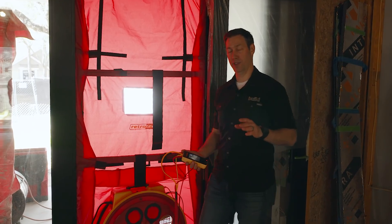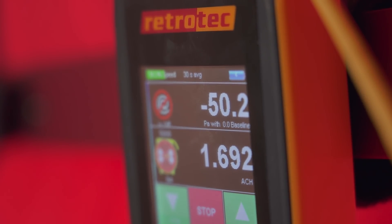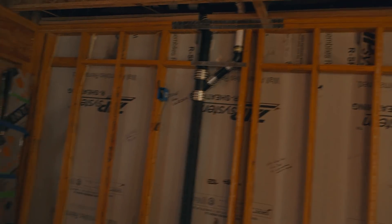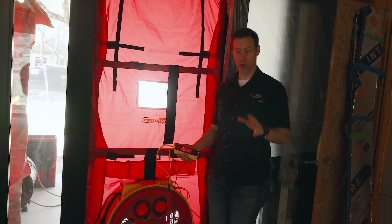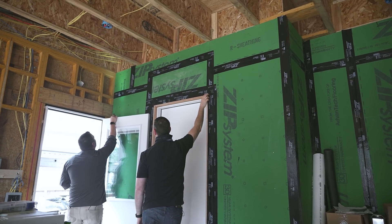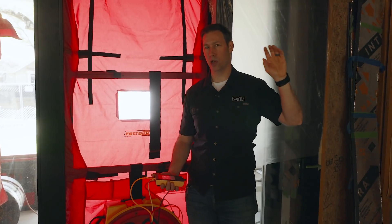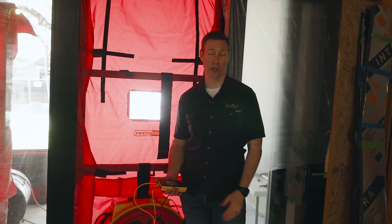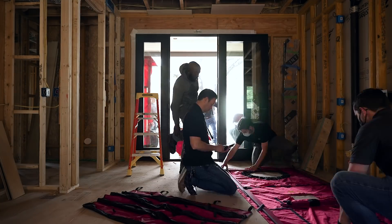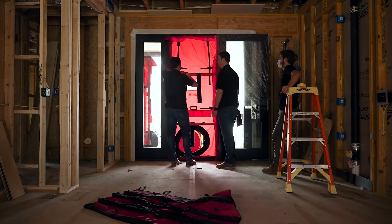It's been a day or two since Jake left. I was honestly a little disappointed with my number — we were around 1.5 to 1.6 ACH-50. But this right here, I had a feeling, was a pretty big culprit. We didn't do any real air tightness measures between the house and the garage where my floor system was. So I had my buddy who owns a rig from DAP come in — basically a froth pack type system with closed cell foam — and we sprayed this area at the top of the wall separating the garage from the kitchen area, plus a few detail areas in the garage ceiling because I've got a second floor above my garage. We're going to run the blower door again and see what we dropped on this house.